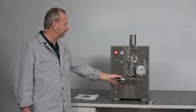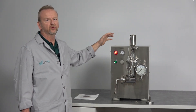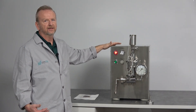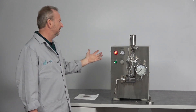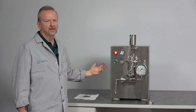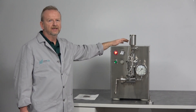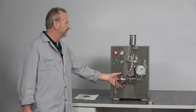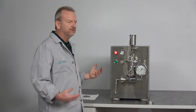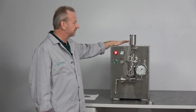It's motor driven and also has some pneumatics built into it that actually control the pressure. I'm quite impressed with it, and the biggest thing I really like about it is how quiet it runs and the amount of pressures it produces. Basically, the technology behind it is it's got an electric piston pump that's completely embedded in oil, and then it has a pneumatic diaphragm for pressure regulating, and it seems to be built from the ground up.